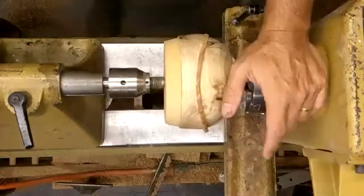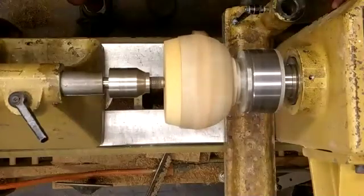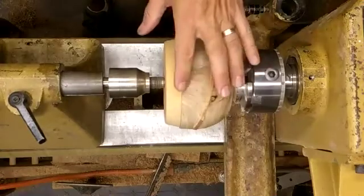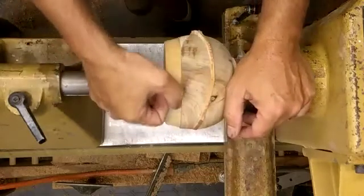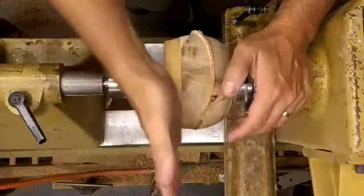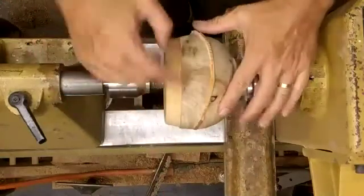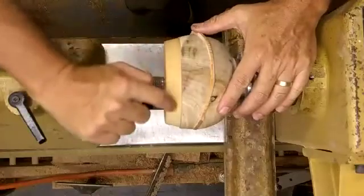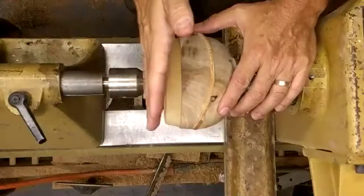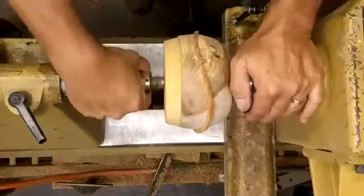The other thing to mention is every now and then when I spin these, and that one sounds real nice, I'll get a buzzing noise. We'll get a bzzz, and what happens is the face of the bowl isn't true. It's got turned or warped or something like that. And so if this plate, this MDF that I'm using in this case, isn't touching this perfectly, it can't follow this circle. And so it's going to wiggle and wobble. And that's the noise that you hear.